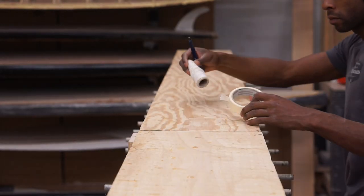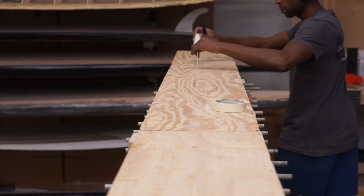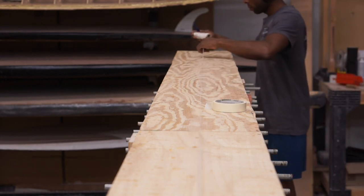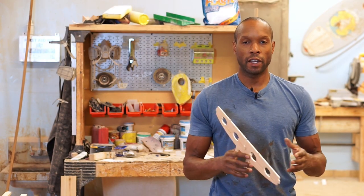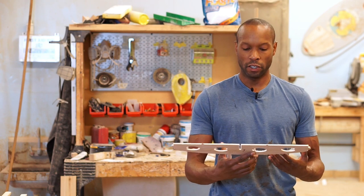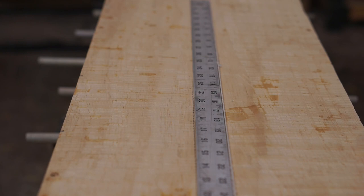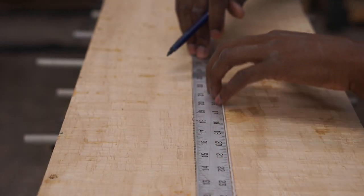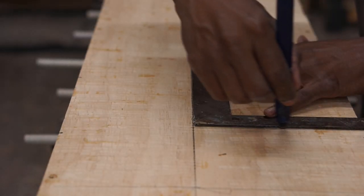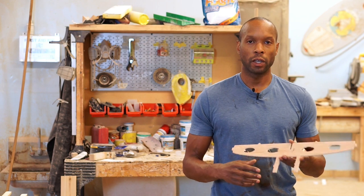When you're ready to start assembling, you'll need a long flat surface — it could be a table or two sawhorses with plywood clamped across them. It doesn't need to be as wide as the board itself, just wide enough for the legs to stand on. Once you have that flat surface, draw a line all the way down it and make hash marks or cross marks for each cross section where the rib will be positioned. That's going to be helpful in the next step once you start gluing it all together.